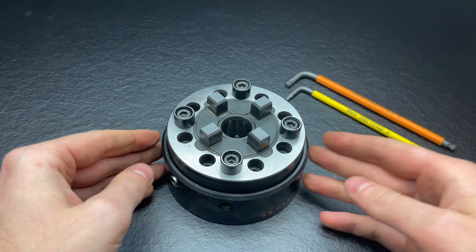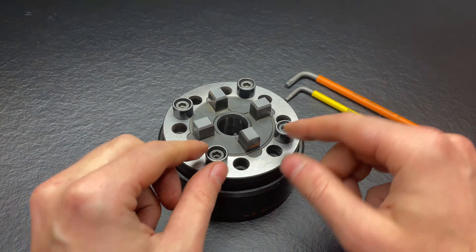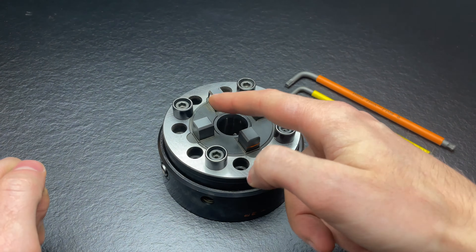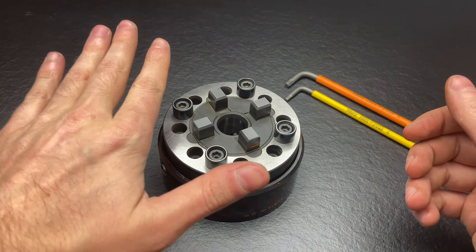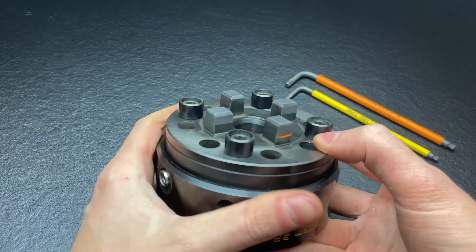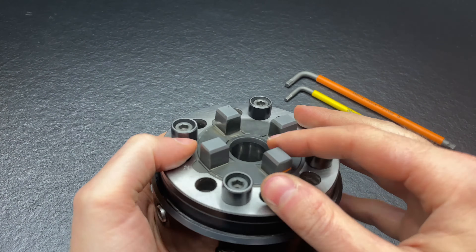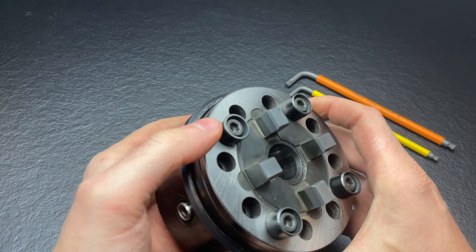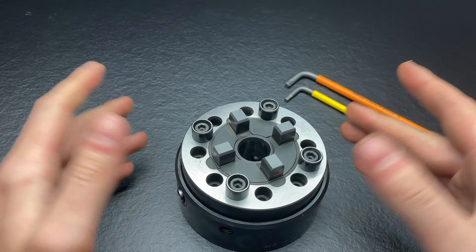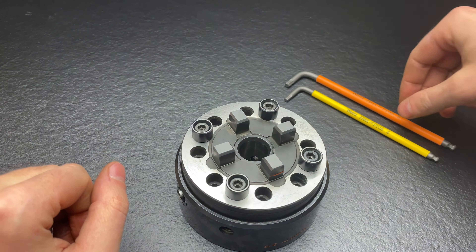As you can see here, there are different geometric reference points. There are four studs meant for the Z offset, and also four studs meant for the X, Y, Z positioning and rotation. These are actually made of carbide — they are brazed onto the base plate, which is awesome. They are very wear resistant, and the mating surfaces are made of steel but don't wear much because contact is only from the top, not from the side.